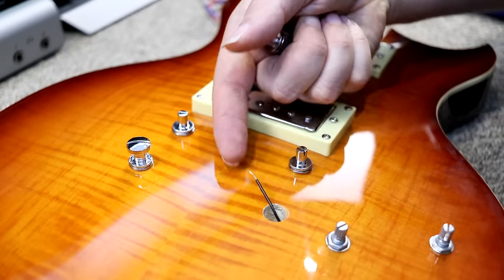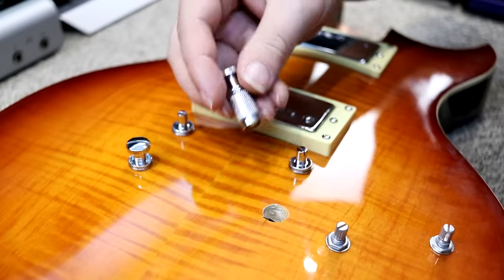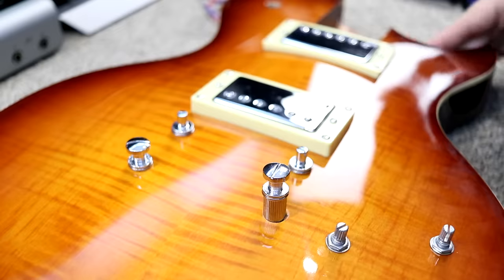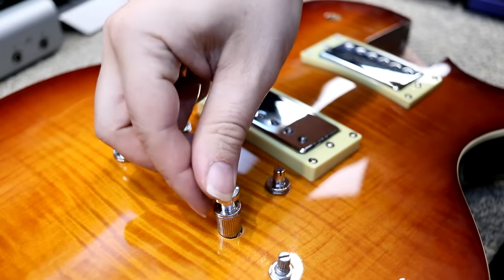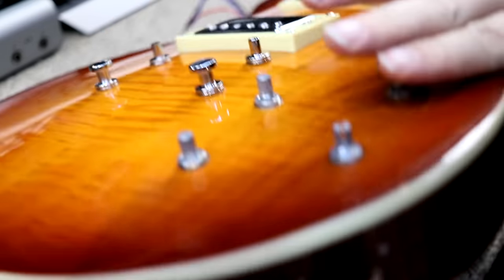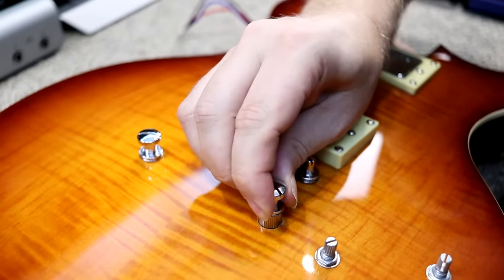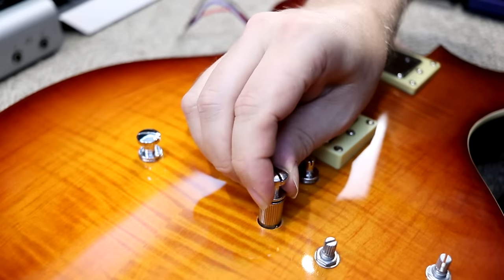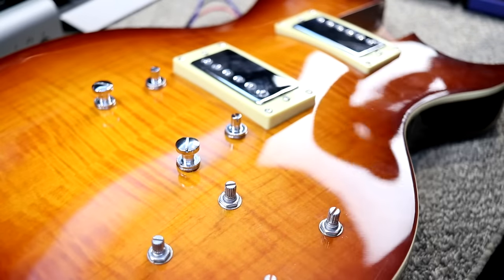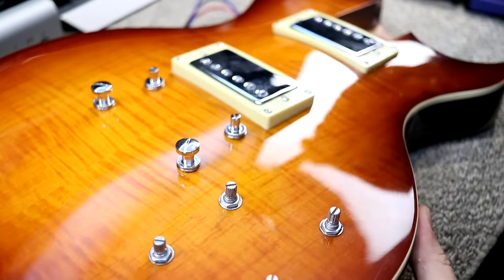Here's our ground wire — I've stripped it back just a little bit. I could probably do a little bit more because we want to make sure it has great contact with the post. I'm going to scooch it to the side so you can see there's just the very end of the wire right there. When we push down and seat that, we can be assured we'll have a good contact with your ground. Even though it is a kit build, you want these pickups to be silent — you don't want all that horrible buzzing. So let's seat that and we're good to go.